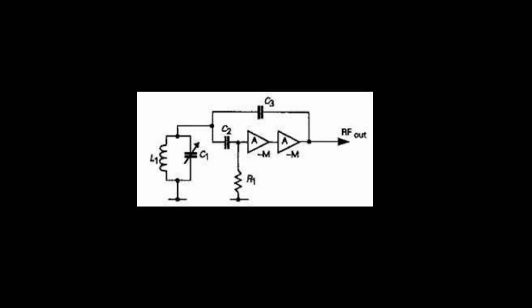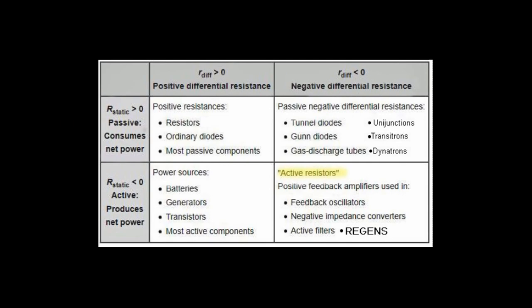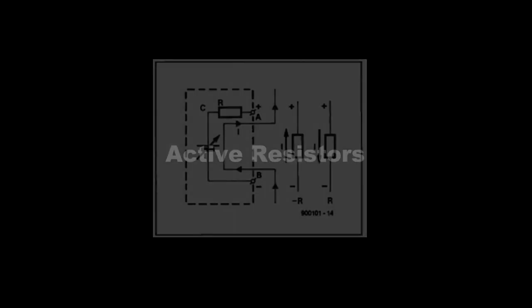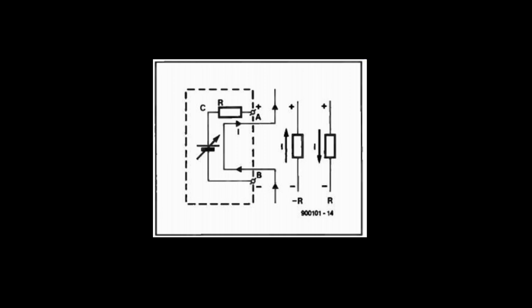Why is the Franklin considered a negative resistance device? The answer is that it's really not a negative resistance device — it's a circuit that produces negative resistance from feedback. In addition to passive devices with intrinsic negative resistance, circuits with amplifying devices like transistors, op amps, or tubes can present negative resistance at their ports. In circuit theory we call these active resistors: applying a voltage across the terminals causes a proportional current out of the positive terminal — the opposite of an ordinary resistor. Connecting a tuned circuit to it causes an injection of current rather than loading it.